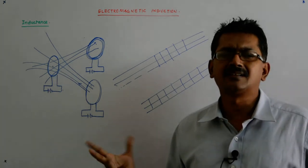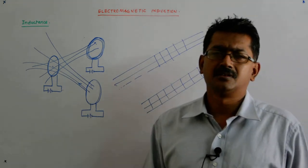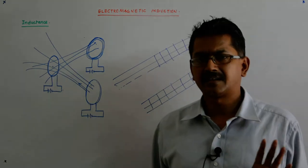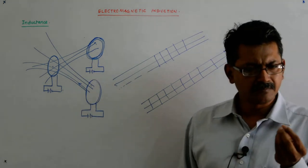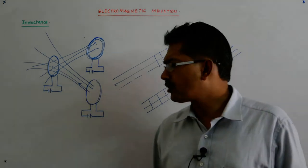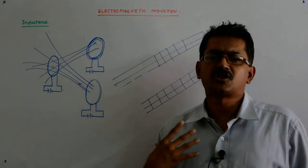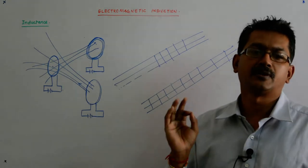When there is no train, there is hardly any current being drawn, except for the current that the transmission line otherwise keeps on taking up. That you'll understand later due to the capacitive things. And so some minute amount of current. So it becomes really a difficult task to calculate it. Still, it can be calculated, and the fundamental again remains the same, d phi upon dt.